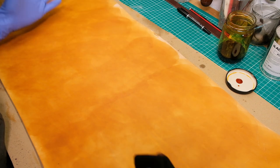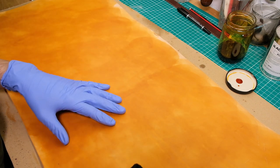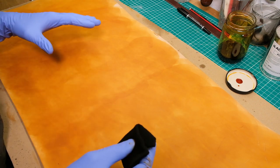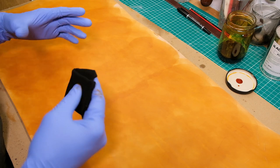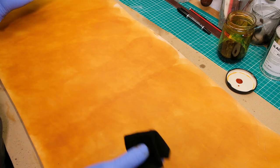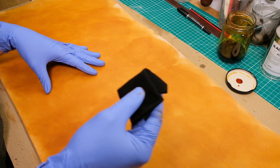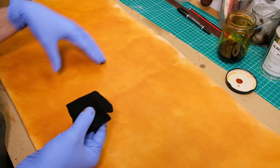The first coat, as you can see, is not brilliant — that's totally normal, and this is why I diluted it. I wanted it to be very light and not go too dark. I'll be putting on a second and third coat — I always do three coats anyway. Progressively the color will be more and more even as it dries. With a diluted dye you can go back and redo areas that are slightly lighter than others without too much worry.